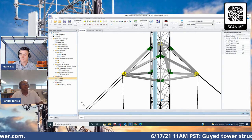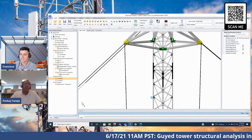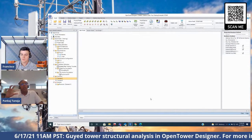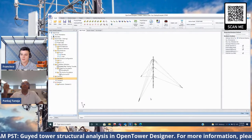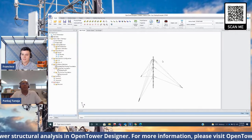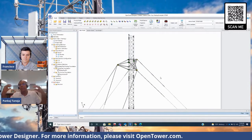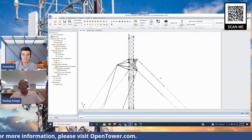Wind loading, yeah. For wind loading, you hit another good point. So, wind loading on cross arms, right? If we go to the TIA code, we have the definition of a panel. We know how to calculate the wind area on a panel based on all those dimensions.